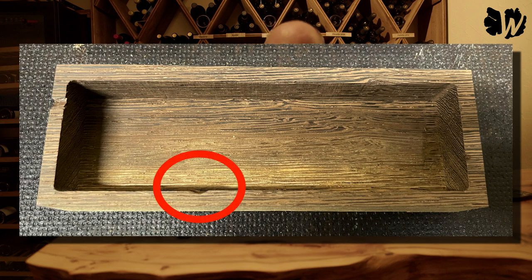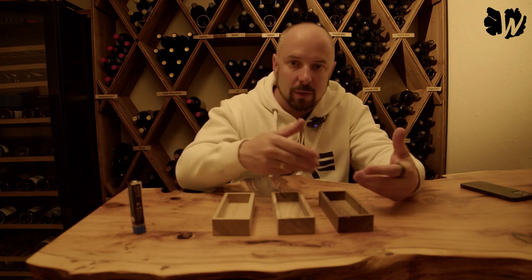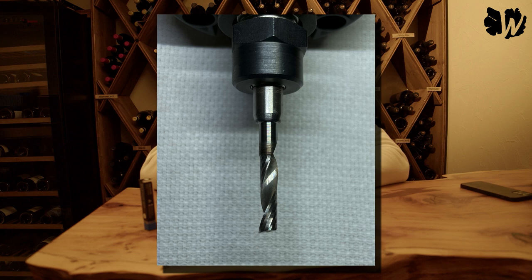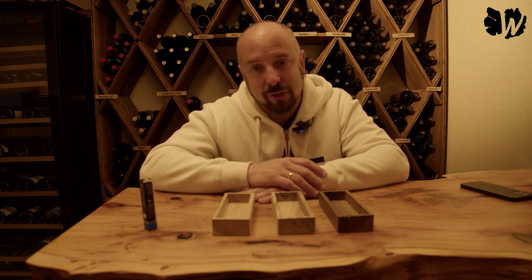Regarding the cut quality on the wenge, that was not as nice as the others. There's a clear dent in the inline cuts and a piece of the wood was torn out — though that's not necessarily the fault of the bit, because wenge tends to do that. It was okay, but it really puts a lot of force on your material, on the wood, on the bit, and also on the Shaper Origin. Now after using this on wenge and looking at the bit, there were some signs of usage — though you always have that when you use a bit for a while. It's clearly not fried; it's still very sharp and very usable. The bit survived.